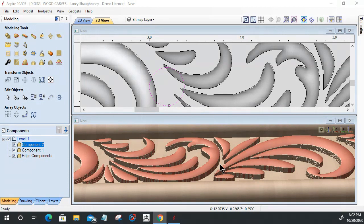When it comes to pressing plastic injection moldings, the molds that the plastic is injected into have a draft added to them so that those parts slip out of the mold. In the case of this, I want to add a draft to the part, so when my finish bit is cutting, it has a little bit of a ramp to come down instead of a straight plunge down.